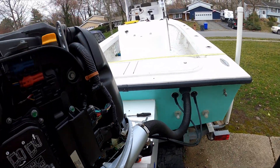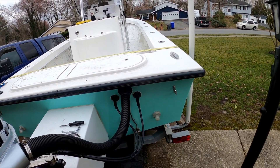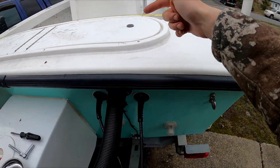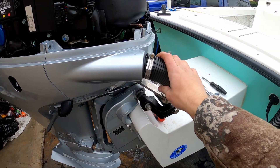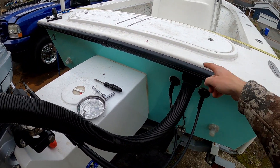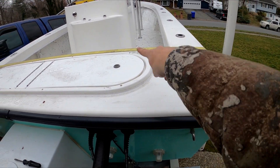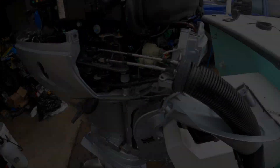All right, it's a couple days later. Finally got the fish tape from the console up here — my fiberglass one wasn't cutting it, so I used my metal fish tape. That's up here coming up through the rigging tube. So I've got to run my other fish tape through here, put a string on there. I'm going to take this part off and loosen the rigging tube a little bit so I can run the cable into the transom, then we'll pull it up to the console. That's the hard part, and then I can hook up all the NMEA stuff.